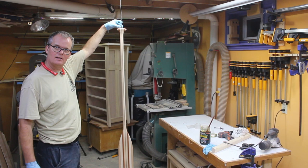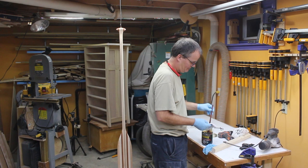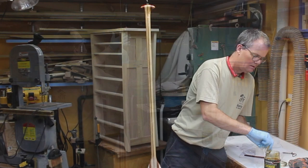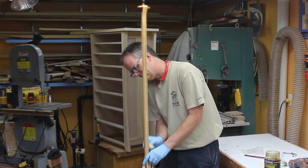When it comes to finishing, I drill a hole in the handle, put a little hook in it so I can hang it from the ceiling, then I use spar urethane and wipe it on with a rag — because you're not putting on very much and it seems a waste to get a brush dirty only to have to clean it again. Tomorrow I'll give it a sanding, put on another coat, and another coat, and so on and so forth. So — you think it's any good? Let's find out.